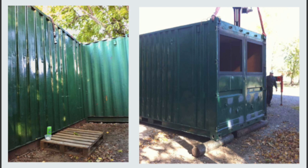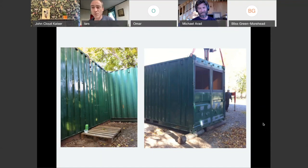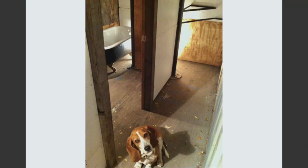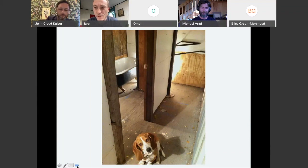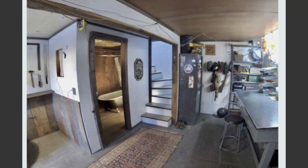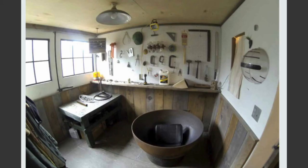If I'm really going to make this into a truly livable house, I have to have a proper bathroom and a little bit more space. On the right-hand side, you see container number three, which was appropriated for use. I decided to go double-wide — once you set the two containers side by side, you can begin to cut the walls between the two. This is an image of the divisions that were starting to go into place to divvy up that space. On the right-hand side, the first beginnings of the stair treads, a staircase to lead to the second floor. There's the finished staircase, accomplished by welded steel supports to a vertical column.